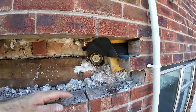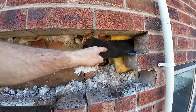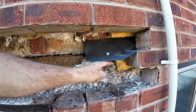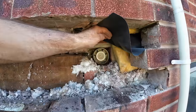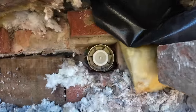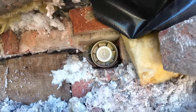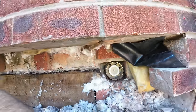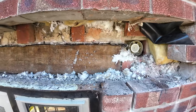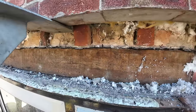Got a bit of fettling to do here because this tray comes too close above this tray, so we've got an upstand here, and then we'll have to tuck it in underneath our vent that we're putting in. As you can see, that's never had a pipe on it, so we'll be slotting the pipe over that and building that in. And the first job after break is clean all this out, hoover it all out,